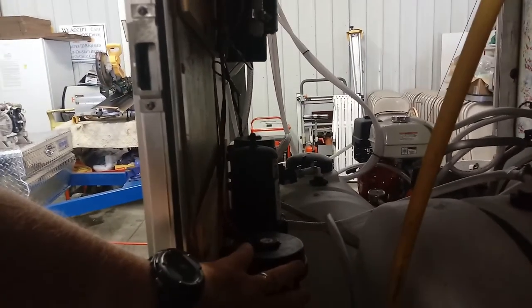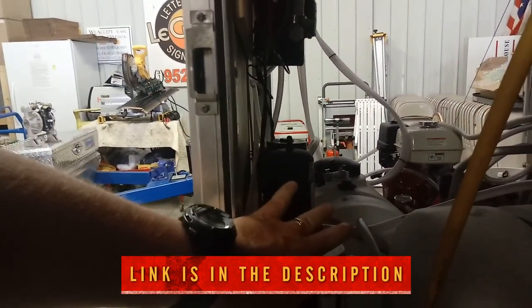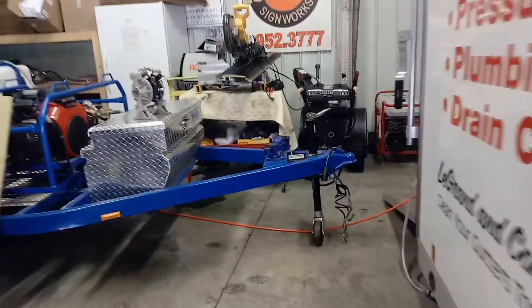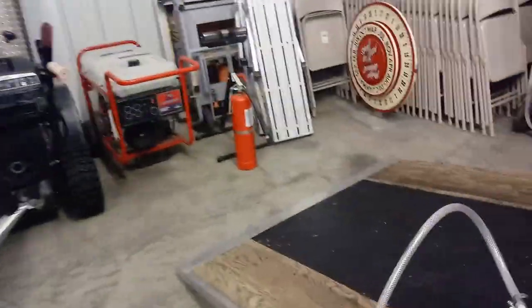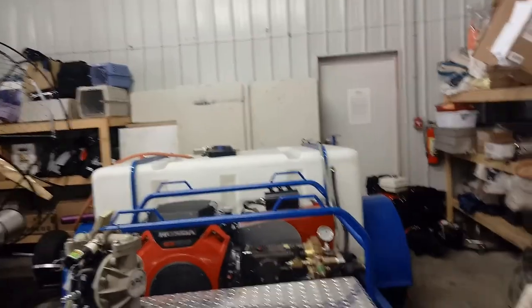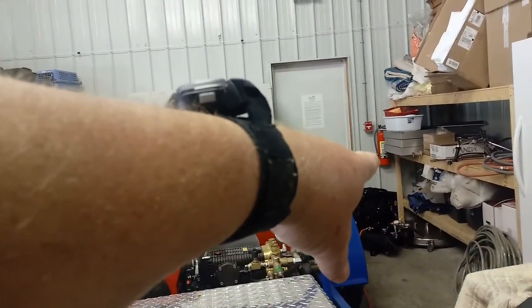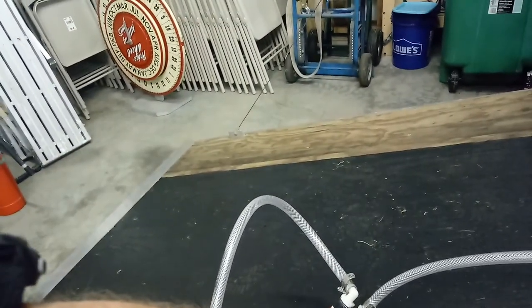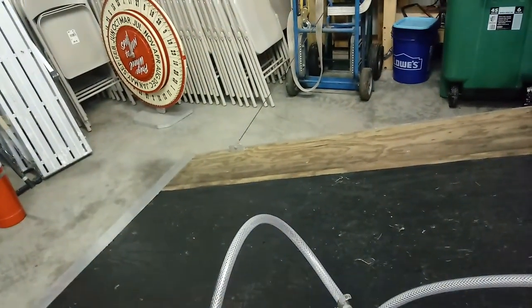The pump we're going up against is the fat boy pump — rated at about seven gallons a minute at around 60 psi. It's fed by half-inch hose going into a dipstick with a check valve, hooked into the same hose via cam connection. The air diaphragm pump has a quarter-inch air hose driven by my wheelbarrow air compressor. It's rated to run from 20 psi to 100 psi; we're going to set it at about 50 psi.